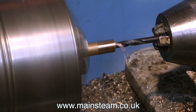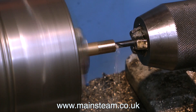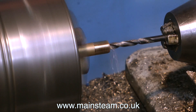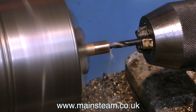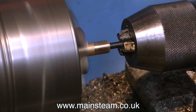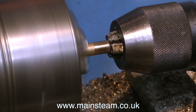Because this is quite a long piece of brass, I have to attack it from both ends — and I do use the term attack lightly — so I'm using a 3/16th of an inch diameter twist drill and I go in first of all from one end and then from the other. Hopefully the drill will break through into the hole somewhere in the centre of the brass, preferably without snapping off. So when you think you're near the breakthrough point, take it easy.